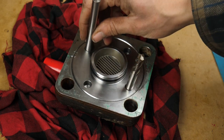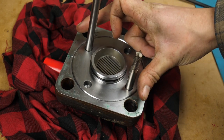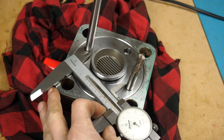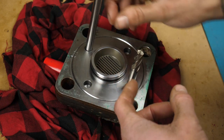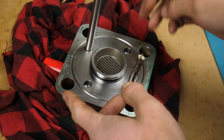These holes are something like 10.3mm so there's quite a bit of slop in here. So to measure these I'm going to get some calipers and measure on the outside — they'll flex in. Measure on the inside, they'll flex out. And if I measure at the same height I'm thinking the in and out flex will cancel out and we'll get a true reading, or at least near enough for what we're doing here.